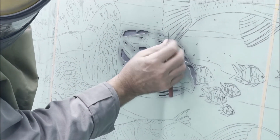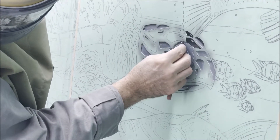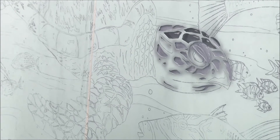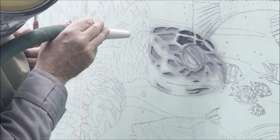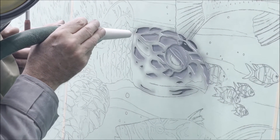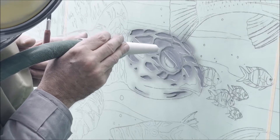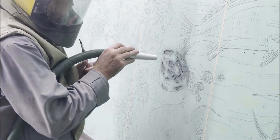Through the sandblaster, hose, and nozzles ranging from thick to thin, we control the sand to do whatever we want. When the sand comes out of the gun and hits the glass, it starts to eat away and erode the glass, allowing us to sand carve into the pieces. We use this process kind of like a glorified airbrush — we can turn up the pressure to carve and cut into the glass, or back off the pressure to do light shading and tone work, combining both for maximum effect.